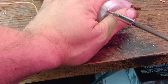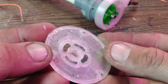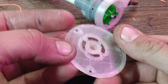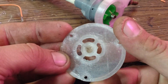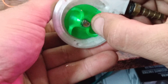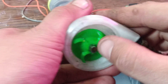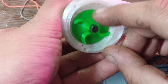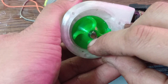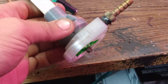I'm going to disassemble it to see if there's any other physical damage to the impeller. There's no visible wear other than a little bit on the face — probably nothing you can even see on camera. Inside seems to be alright, just a little friction marks here and there. I'd probably just take a file, emery cloth, or die grinder and peel a little off — that's probably where the noise is coming from. I don't see any damage other than the crack, which is more of a printing failure than anything. Overall, a success.